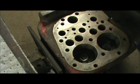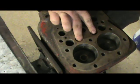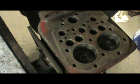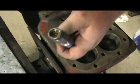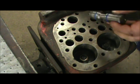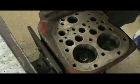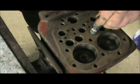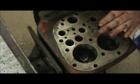Alrighty. We'll put our two valves in here in the center, and little poppet screws on the bottom of those. I just put a little assembly lube to hold them in place. Put a little assembly lube on the end of the spring, stick it up in there, and that'll keep it from falling out the end. Brush a little bit of assembly lube on the two O-rings. Push them in, let it bottom out.